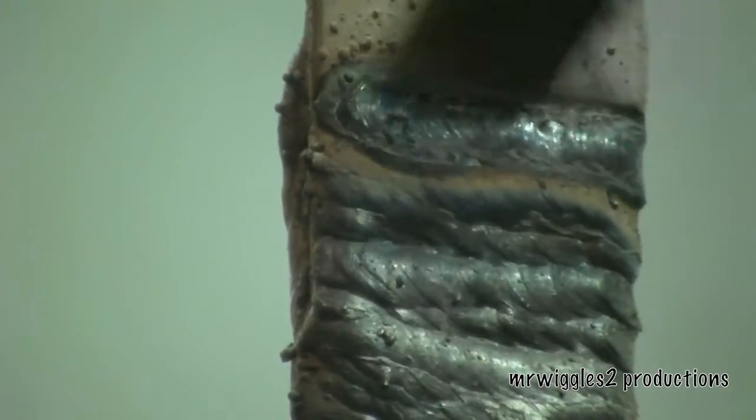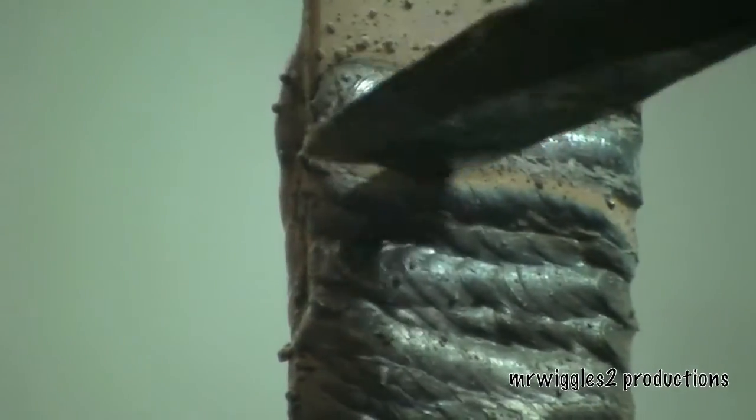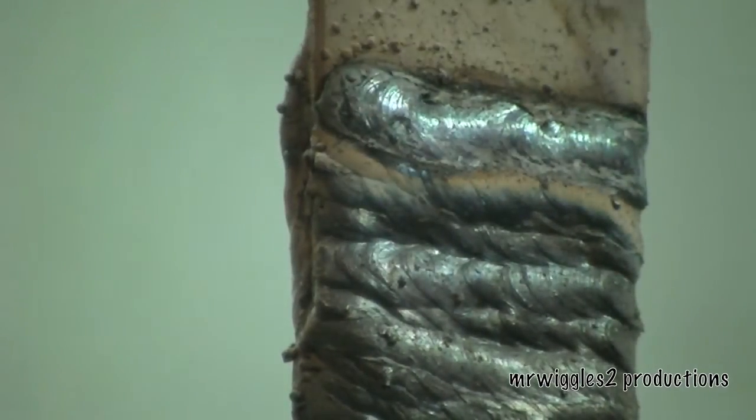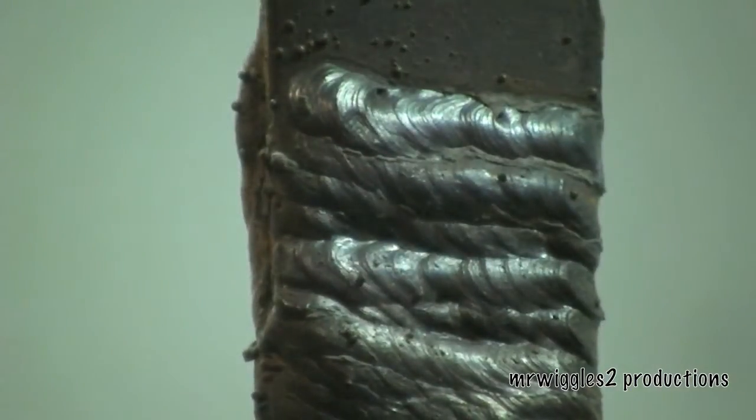What I'm finding out here with this up-close video is that I'm not cleaning the toes of the weld and my brush has withered away to almost nothing. So I'm actually getting some slag inclusion in these welds. You can see it's actually a little porosity, but basically it's due to the slag. Got to clean those better so I get a better weld and the slag doesn't come out like that.